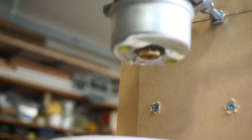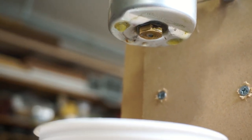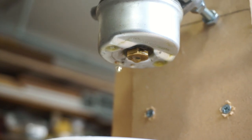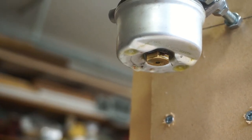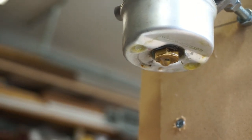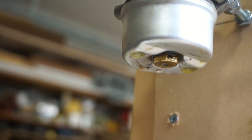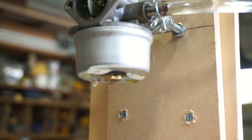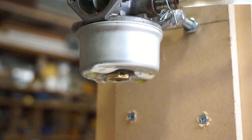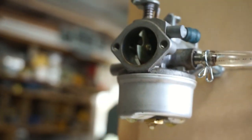That's the issue, and I want to investigate what's causing it. We've tried different things — there's a new gasket on there and I used gasket sealer, but it looks like the fuel ate it away because I don't see it anymore. I thought the aluminum bowl had a cut or was dented enough that the gasket wasn't sealing it, but I'm not really sure. That's why I made this — so we can investigate.